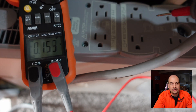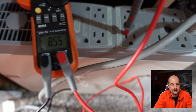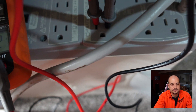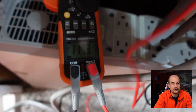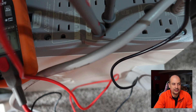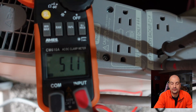As soon as I pulled the multimeter out and started checking voltage between the pins, the problem became apparent. Going across the line and common I get 117 volts, but from line to ground I'm getting 75 volts, and from common to ground I only get 51 volts.